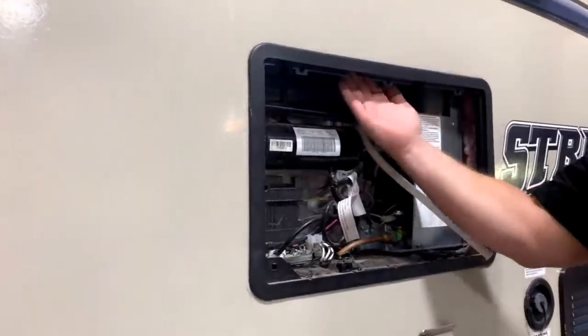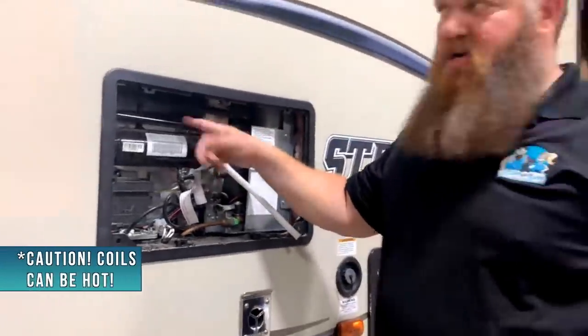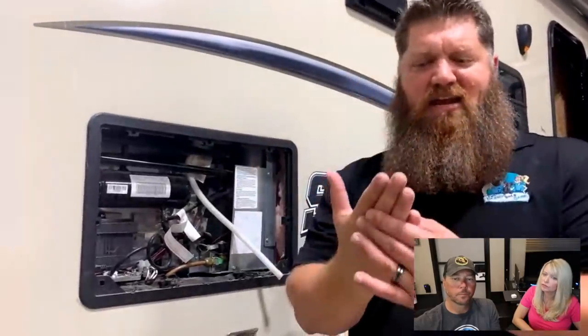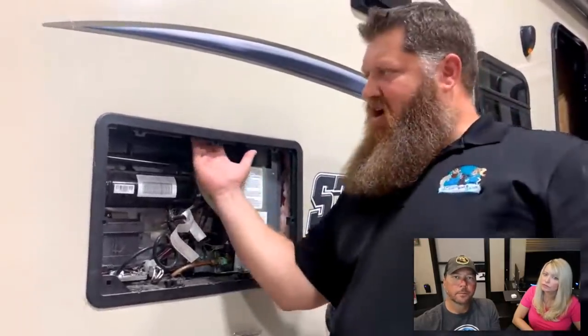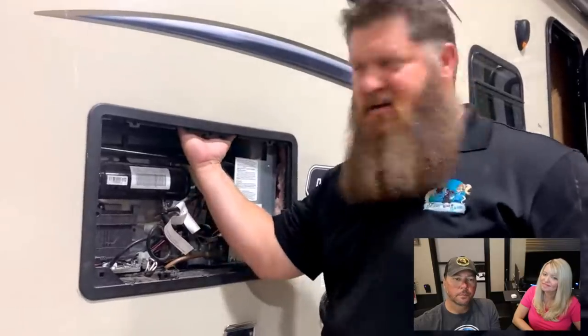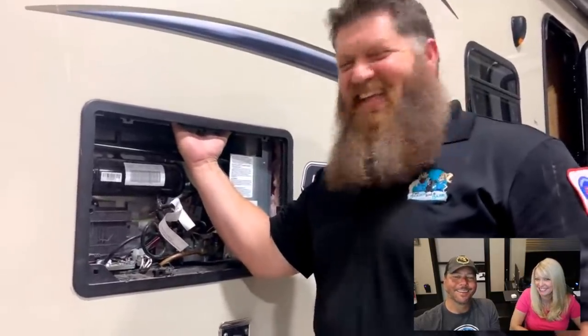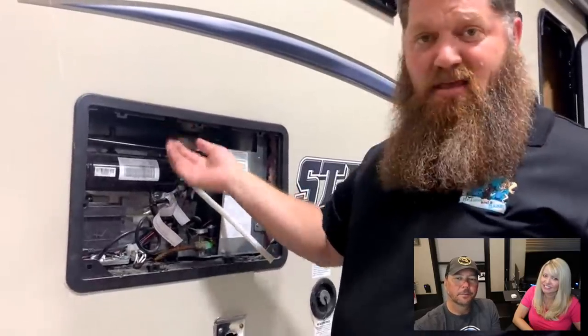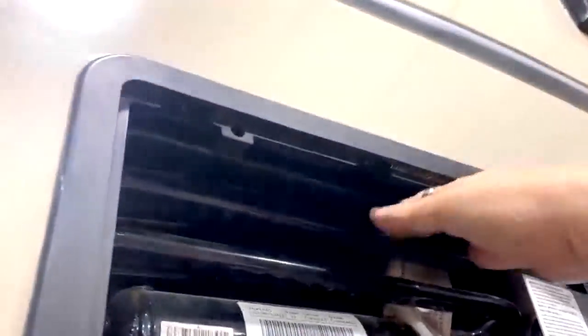The closer that our refrigerator coils are to the wall, the better. What we say is a half inch between these coils right here and this wall. And the best way to do that is stick your hand up there. And it should fit somewhere. I have fat fingers, so it's supposed to stop. But if you have a pretty big gap, you can get just a baffle, piece of cardboard, something like that. Just lay it right up here and force that air to get closer to the coils.